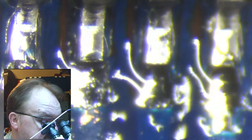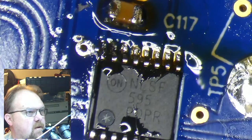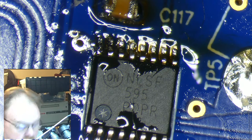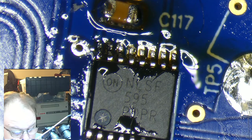So I'm just touching up the joints. Make sure that the solder between the pin and the land pad has a chance to melt, and I'm sure it does. Okay, it's on. Now, what would make this easier? There's no way I could do it without the desoldering braid. I'm sure, regardless of what I used, even just the slightest movement of my wrist or hand or shakiness would cause a problem. So the solder braid, I would say, is pretty critical here. But man, I wish I had applied that capacitor later, not now. Anyways, that is probably the most challenging part on the board, and that is the last part on the board.